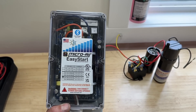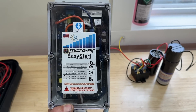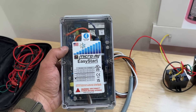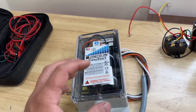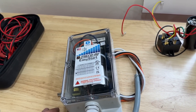The idea behind this is that we are slowly starting the compressor and throttling the current that goes to the compressor until it's fully started. You can use this as a surge protector or as a diagnostic tool. It will tell you if your unit is short cycling, if the compressor is pulling too many amps, or if there are other issues.